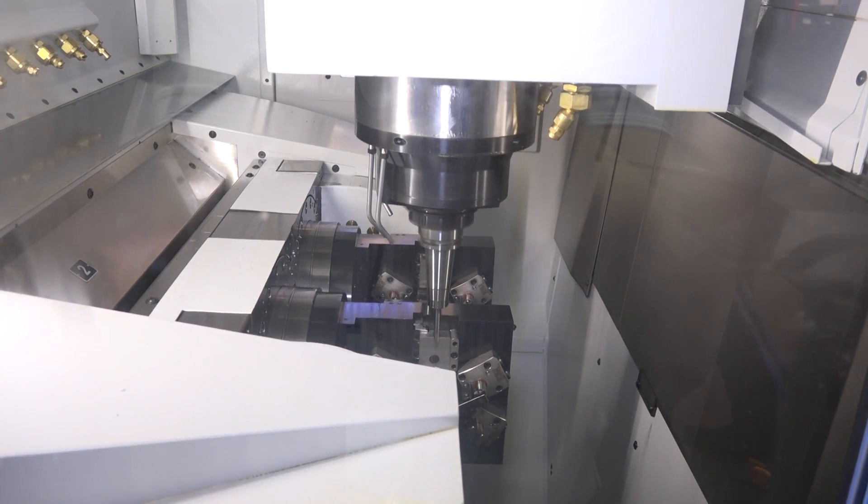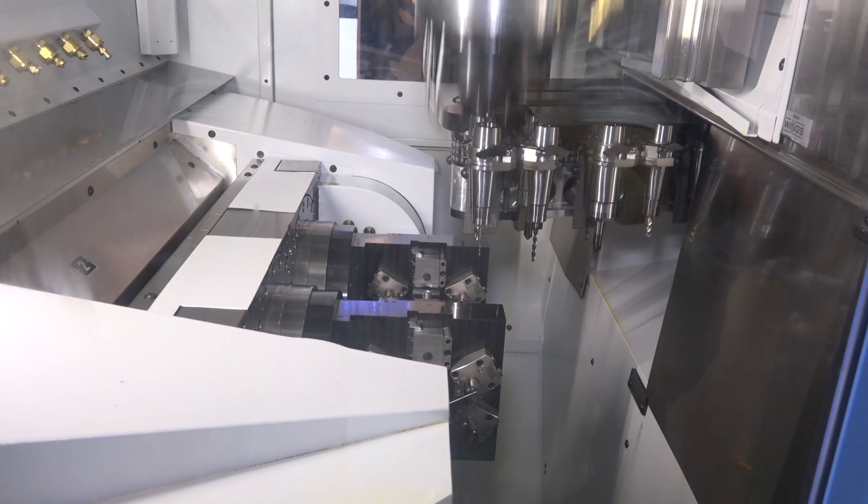And where are you likely to sell a complete cell like this, Graham? We've had good success with this cell already in the UK this year. Ideally, the turbocharger market is absolutely massive globally and there are a lot of UK players involved in that particular market. That's where we've made the first successes — on bearing housings, with a sub-80 second takt time. That's what the guys are looking for based on the volumes we've been looking at. So if it's throughput and production you need, this could be the right solution. Absolutely — hopefully those are the sort of enquiries we're going to get for this cell.